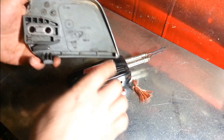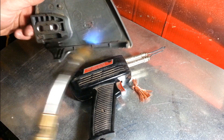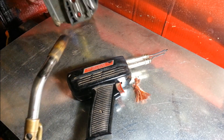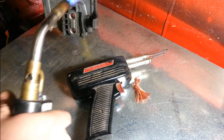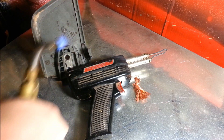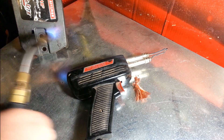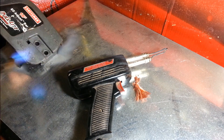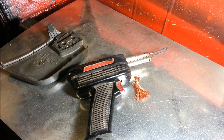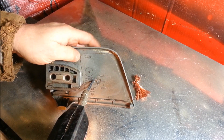It's pretty cold outside right now. I'm going to heat up the plastic just a little bit because this piece is probably about 20 degrees right now. The whole piece is warm to touch, and now it will weld better.